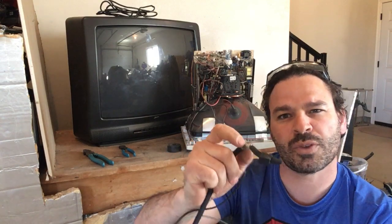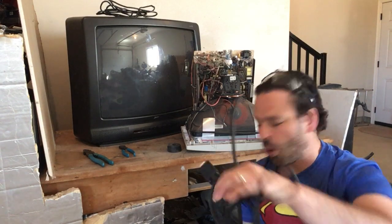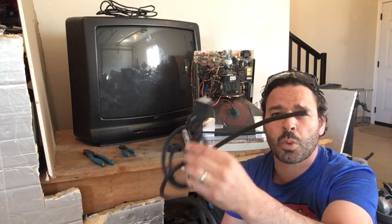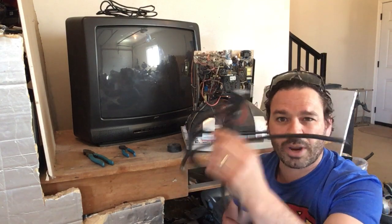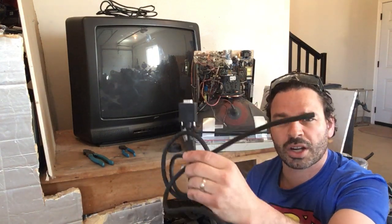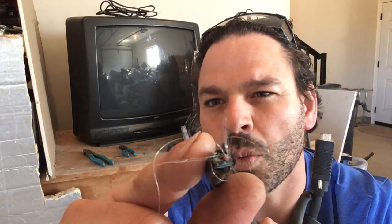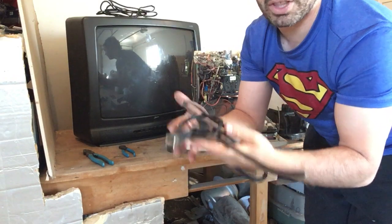Sometimes it will be copper inside if you have metallic look, if you scratch it, but these are going to be called electronic wire, and it's going in a category of low grade wire. It's still worth something. Currently, these wires are going for 90 cents a pound, so better than nothing and a great price, but you don't want to throw these into your copper appliance wire because you will be downgraded. So this is electronic wire. Very simple, as I said, to recognize. If you open it up, you can see the wires in the middle, and there's always going to be a metallic casing around it. So low grade wire, but still, this is very heavy. There's about a pound here.